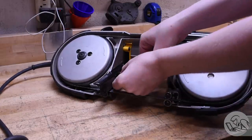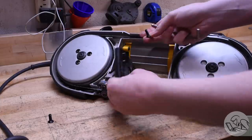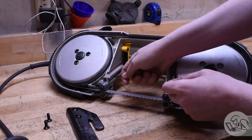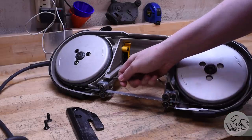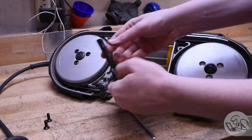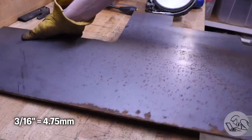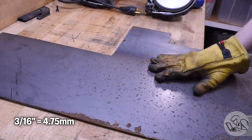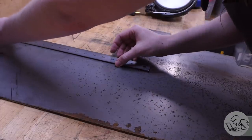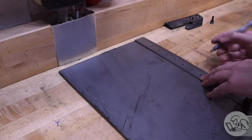So I've got to get this factory backing plate off of here. This is where the table will mount, just like the ones that you can buy do. Interestingly, there's actually a T-slot behind that and kind of a long skinny double T-nut that slides back and forth, making this plate adjustable — I didn't even know that was adjustable. It's quite a heavy plate actually, looks to be 3/16th steel. Speaking of 3/16th inch steel plate, that's what I have here. The commercial ones seem to be quarter inch plate, so I didn't have anything quite that heavy, but I think this will work for my use case.